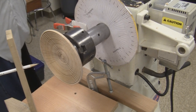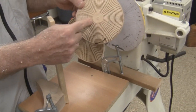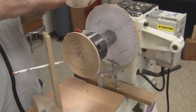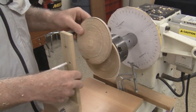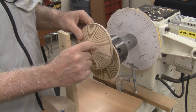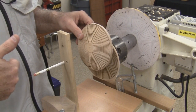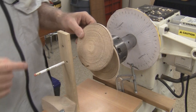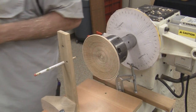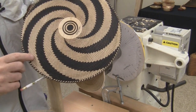Through the magic of television we have one here that is all indexed. I've also taken off the tenon and added a few more beads when I did that. When I have to take this off to remove the tenon I'll just stick it back on my chuck, stick a mouse pad in here, put it up against the chuck, bring the tail stock in, and I will turn away most of the tenon and finish up the back adding however many beads I need — which is 17 beads. After I finish the beading I leave a little flat spot in the middle where I sign it. If I'm doing larger platters I'll sometimes put a couple of beads in there and leave myself a little ring to sign it.